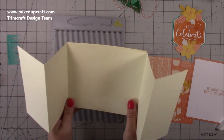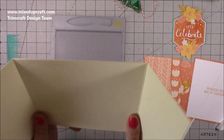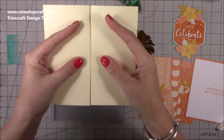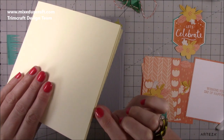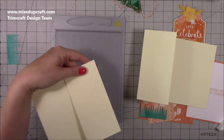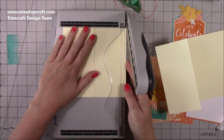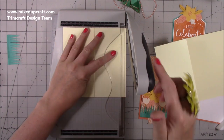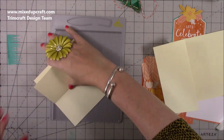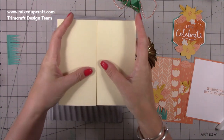One of them is going to sit on top of the other. Whatever one sits on top — because you're folding that piece over, it gets pushed slightly to one side. When you line it all up and go to close it, you'll see it doesn't quite join in the middle, and on the back it overhangs more. What you want to do for more of a flush finish: take the one on top, grab a trimmer and just take a slither off — I mean like a couple of millimetres, if that. You can see there, just the tiniest amount. That will allow it to be all nice and flush on the side with a better close.